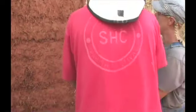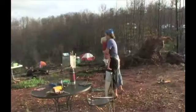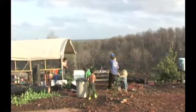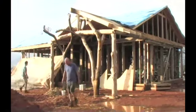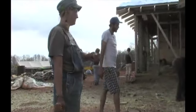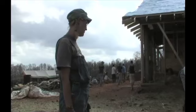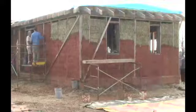Just work it in there, and then it'll dry and harden — whereas loose straw would just want to fall out. And that saves us a handful size of plaster right there. Caliche makes really strong plaster and there's a lot of it around. We're also doing lime on the exterior here, and caliche has some limestone in it, so it tends to do well with lime — they like each other and want to be friends. On the interior where we're doing clay plaster, they really like the red clay. It's going to be clay because it's so protected, and I think they want the red.